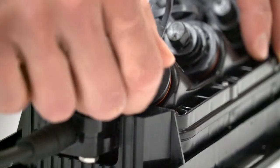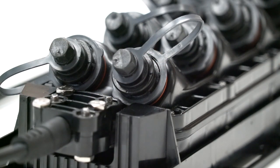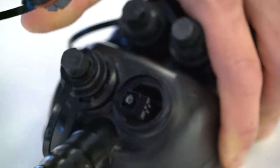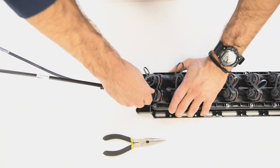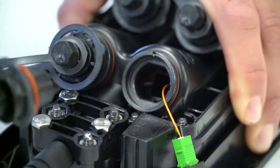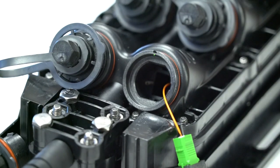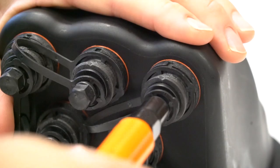If the connector is pulled away from the terminal at an angle, the bulkhead adapter and alignment sleeve may pop off. If they pop off, they can be reinserted into the terminal. This damage may be caused by extreme weather events, improper use, improper handling of the terminal, or an impact to the terminal. If either of these takes place and the bulkhead adapter and/or alignment sleeve pop out of the terminal, be sure to follow these next steps to reinsert the bulkhead adapter and alignment sleeve.